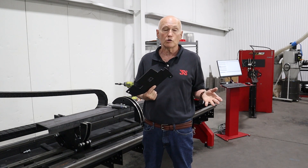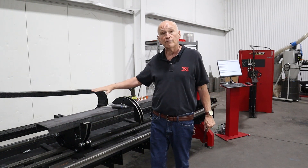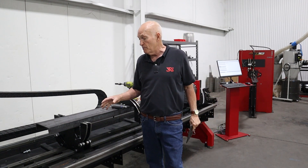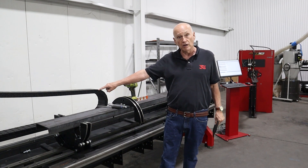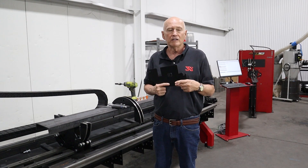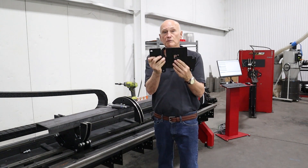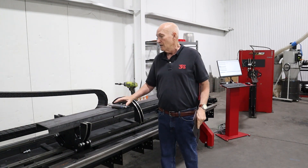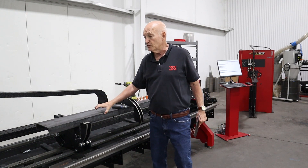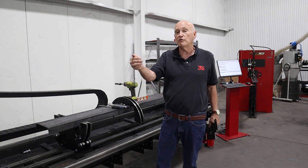We offer a large array of side plates — every conceivable size you could think of for structural steel up to 12-inch I-beam. Keep in mind the XR series can also cut flat plate just as good as tubing, so you can build your own. Check out our support page — there should be a drawing there showing the dimensions of the side plate. We like to laser cut them because plasma cutting is no match for a laser in terms of precision. On c-channel, all structural steel is available in different weights per foot. For c-channel, the width stays the same — eight inches in this case — but for I-beam, depending on the weight per foot, the width actually changes.